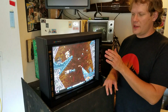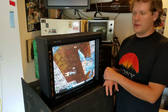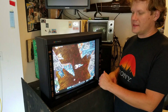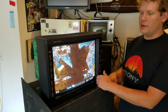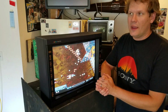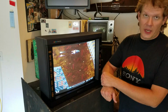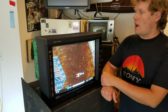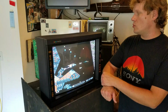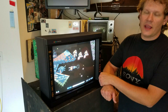Some people use these just for the ability to play movies and use computers that use S-Video or composite. And if you're doing that with this, there's no reason to calibrate it to RGB. You might as well calibrate it for the composite. This particular unit will be going to the Philadelphia Museum of Art, and they will be using it mostly for old videos and video formats. So I will be going back and calibrating this to the screen's settings best for composite and S-Video.